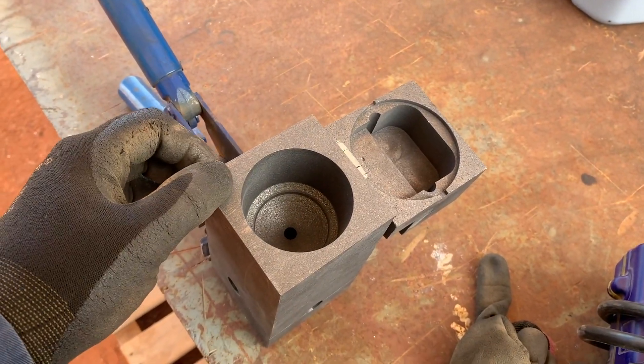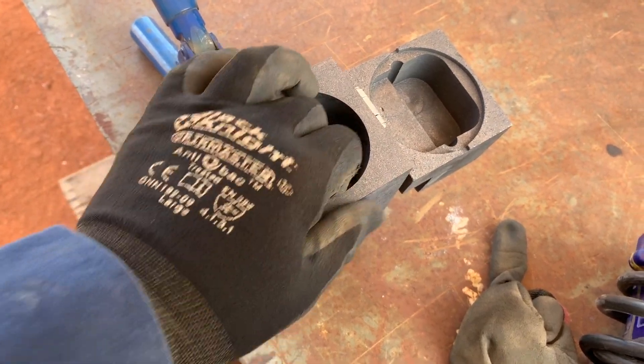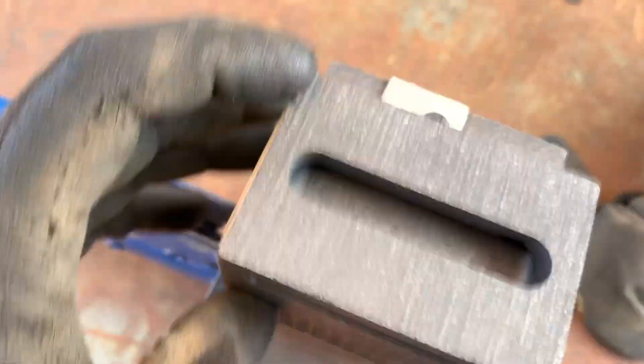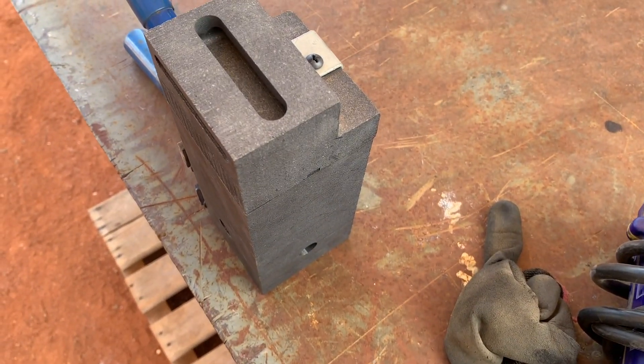The moulds we use are made of graphite, which is a decent material for what it's doing. Although it's essentially a big pencil and will leave marks absolutely everywhere. And it's only good for, on average, about 50 charges — you have to swap these out every 50 goes.